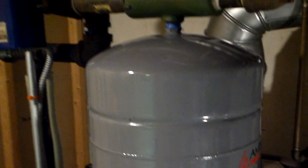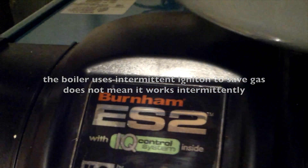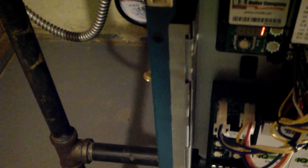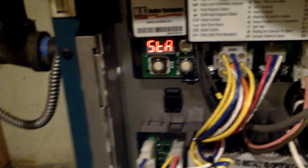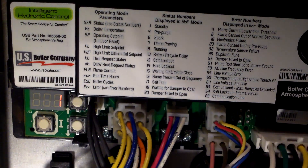Don't just press it and walk away. Now the boiler - this is a Burnham US Boiler, 140,000 BTU gas boiler. When the heating season started, I turned it on and there was heat but it wasn't working correctly. I had to bleed the radiators. Like the water heater, it has a control panel that will tell you what's wrong with it.